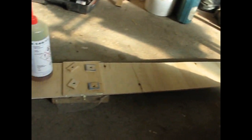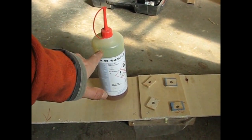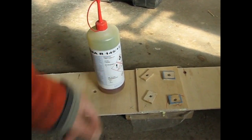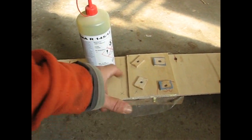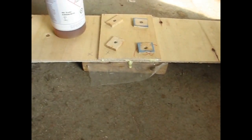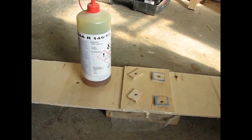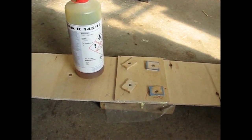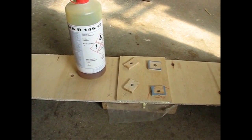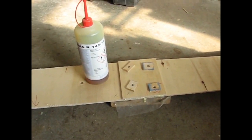For extending panels, this is my new technique and it seems to be working fine. For less important places — this is the knuckle, it's going to be very strong and very narrow — I use polyurethane glue, not epoxy. The stuff squishes right out. I just screw it down into a block of wood. Another great advantage: it takes about 15 minutes and you can keep working. With epoxy you'd have to wait until the next day, or maybe 48 hours in cold weather. Epoxy doesn't work well in the cold.